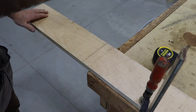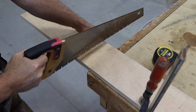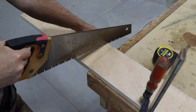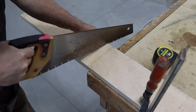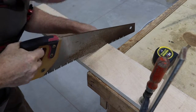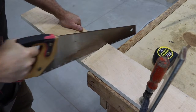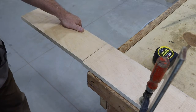To start the cut, hold your thumb to help guide the saw and begin with a couple of easy back strokes to get a groove — it's called a kerf. Then just start sawing away. If you have a decent saw it won't be too hard. Travel right down the middle of your line with one edge of your blade. The further in you get, the easier it becomes — you can take your thumb away. When you get close to the end, hold the piece so it doesn't snap off. And there's your first cut.